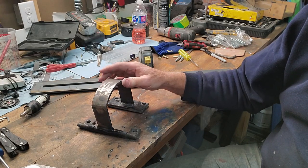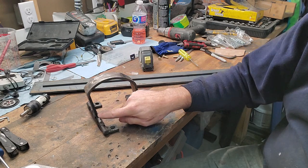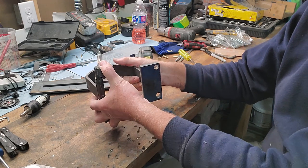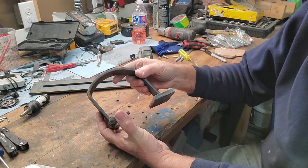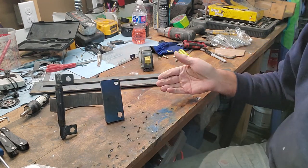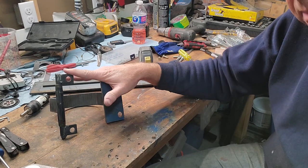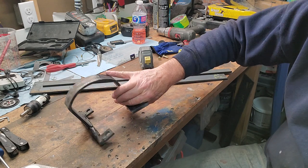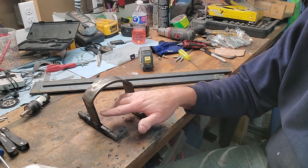The problem with the hinge on the door right now is it's only one and a half inches wide, but it's also got a huge diameter. When it's bolted to the side of the car and the door swings in and out, that allows this to become a huge area for flex. When you put the door on — you've got a three-foot lever on that — and you press it, this whole thing bends. If it can bend, it can't close properly, and if it can't close properly it's going to damage the car. We have to stop that bending.